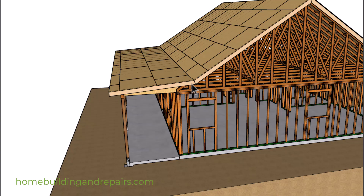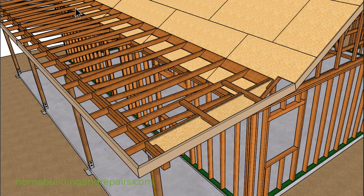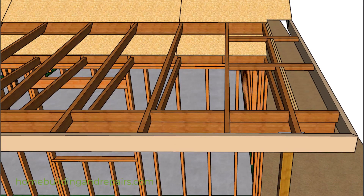In reality, if you're going to go with a longer overhang — for example, something that might be three feet or longer — you might want to use some posts and beams, and these are going to require footings. And then I will provide you with three different examples for building a porch.